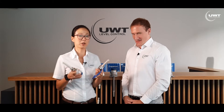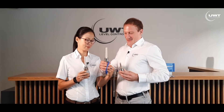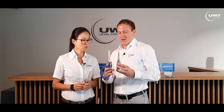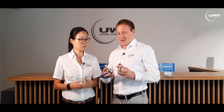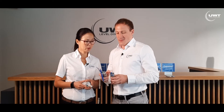Before we get started, I have here the current version of our CN7 series. They are already existing, so we are talking about the CN7 redesign. Can you please explain the scope of the redesign, what are the new features, and what are the differences? Of course. From the first glance of the sensor, it looks extremely compact. We reduced the probe length, and we also now have a half-inch process connection. We have more roundings and short edges for hygienic applications. On the user interface side, the sensor now comes with a cover for the potentiometer and also with an M12 connector. These are the main improvements of our new sensor — thumbs up for the new series.